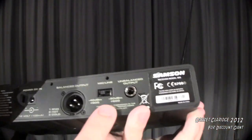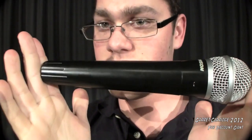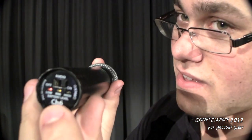You've got your XLR output. There's also mic or line output settings — it just changes the gain level on the output essentially. Then of course the unbalanced output. Overall, this looks almost identical to a Shure SM58 wireless, doesn't it? Are they copying them? It also uses a 9-volt battery on the inside, just like the Shure SM58. I really like how you have to flick it on and then screw the cover on — no one accidentally shuts that microphone off on you, but they can mute it. Having your mute button is essential if you don't have someone working the board constantly.